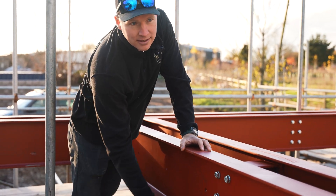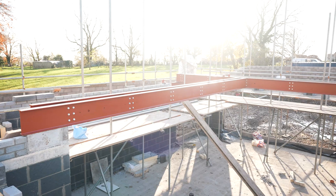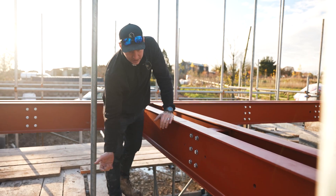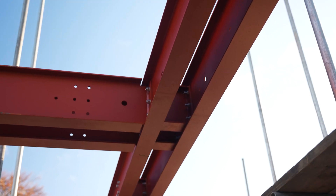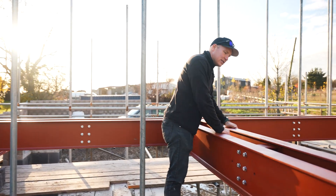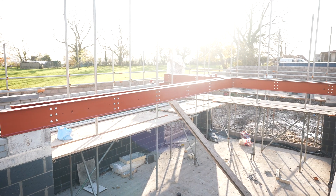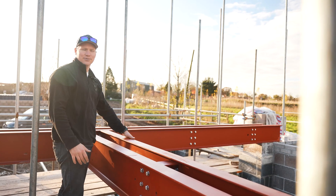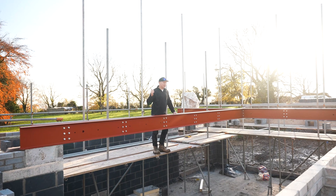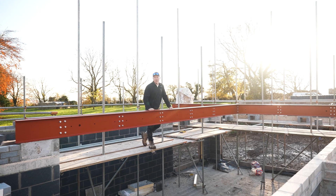These steels are going to be hidden in the ceiling basically. What we do now is we clamp a 9x2 timber in there and then we hang our joists off it, so you won't actually see this steel — this is lost in the floor. From downstairs it'll just be a nice big open ceiling. This one is the flat roof, so this will be roof joists going across there, the flat roof on top. On the inside we do exactly the same thing — the floor joists are going that way and then we just floorboard it. I think we're doing the joists next week and then we might board it after Christmas depending on how things go. Fergie's been flat out on the garage so that's pushed on a bit. Next time we see you we'll be putting the floor joists on. Thanks for watching, I'll see you next time.